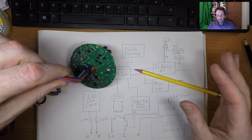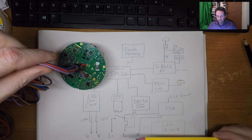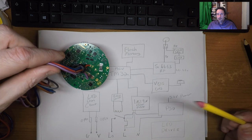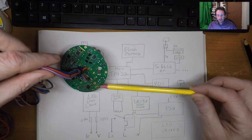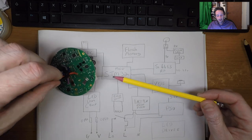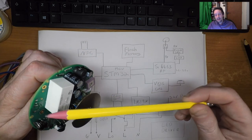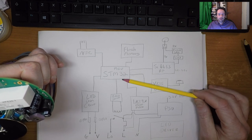The power is quite basic in one way: the power comes in on the live connection and goes via the relay switch to the live out. That's just like a light switch — either on or off. The relay output doesn't go anywhere near the antenna; there's no high-power anything here, it's just switching the light on and off. There's some interesting relay driving circuitry here because this is a latching relay.